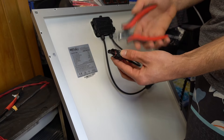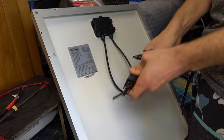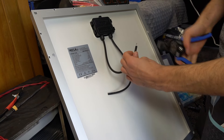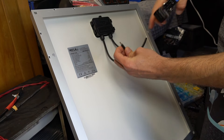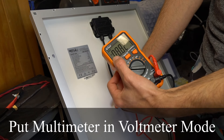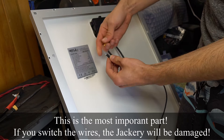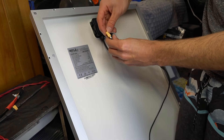First, I'm going to remove the MC4 adapters — if you're mounting this on a roof you need them, but for me I don't. This is my favorite wire stripper; set it to 10-gauge because this is a 10-gauge wire and just strip it. The insulation is really thick because it's UV resistant. It doesn't say positive or negative on the wire here, but there's no negative sign in front of the number, so the polarity is correct — red is positive. I'm going to solder the positive joint first and leave the other cable so I know it's negative.